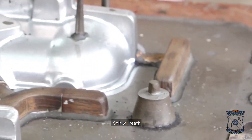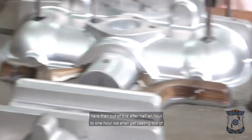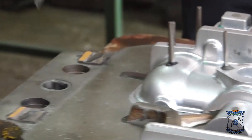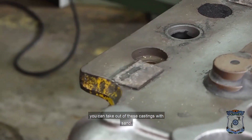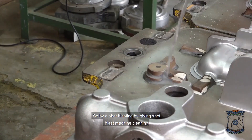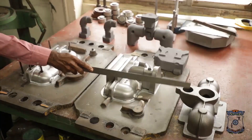The metal will reach many parts. Then, after half an hour to one hour, we shall knock out the casting from this mold. We can take out the castings with sand. By shot blasting — by giving shot-blast machine cleaning and fettling — we shall reach this final status.